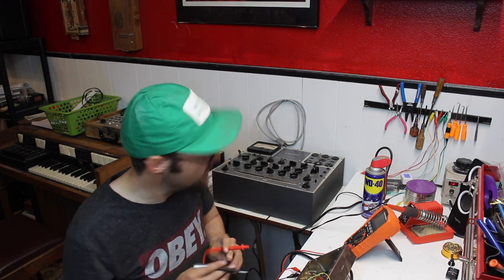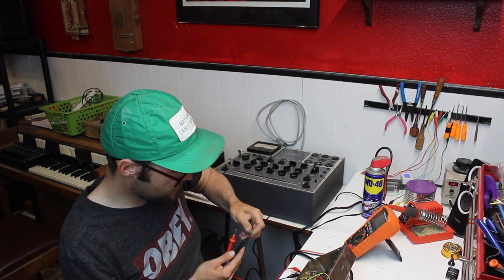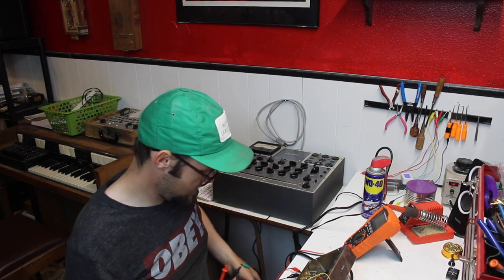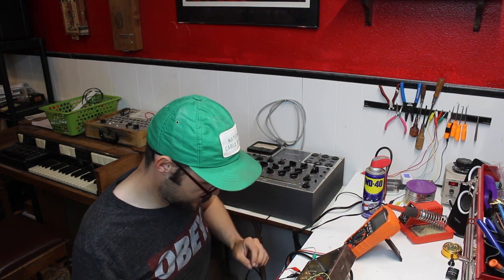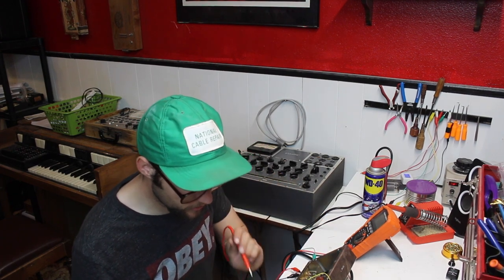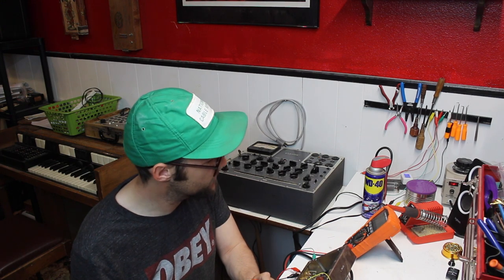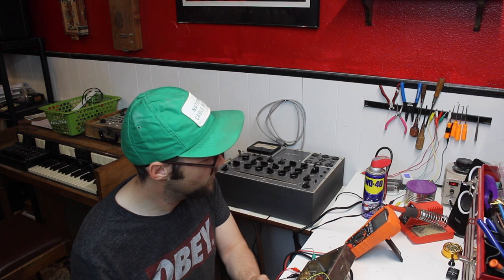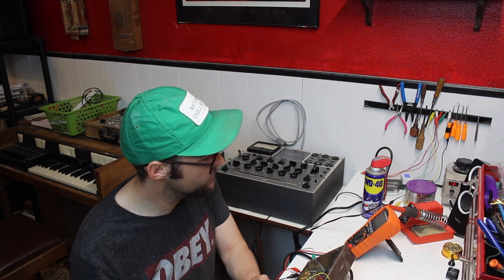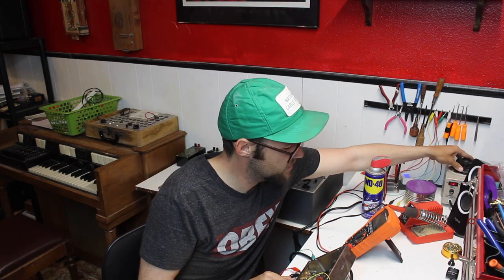We're gonna go ahead and take a gator clip, clip the black end of our multimeter here to chassis, and then we're gonna test our secondary voltage. I'm seeing 160 volts on one of those caps, 158, 156, 155. So we are passing voltage now. We're gonna keep bringing up that voltage on the Variac. All right, so it's 60 volts.